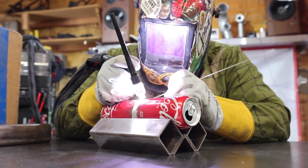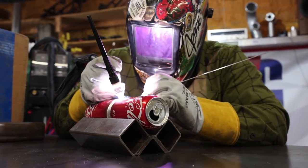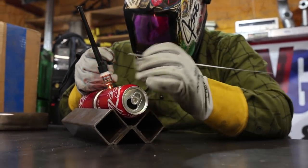The most important thing to remember here is heat control. You're gonna have heat control by adding filler rod, by running the pedal, and by your travel speed and arc length. Managing all of those at the same time, just like any weld, is key — especially with material this thin. Being able to finely control your pedal and get two or three amps here, two or three amps there, is really important.